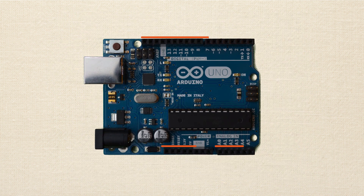One final note about the pin headers: you may hear a term called the Arduino footprint. The Arduino footprint simply refers to how the Arduino headers are aligned. If something matches the Arduino footprint, it means it has that same header layout. The most common example would be an Arduino shield, whose headers almost always match the Arduino footprint. It's not critical to know, but it's handy to understand if you hear that term.